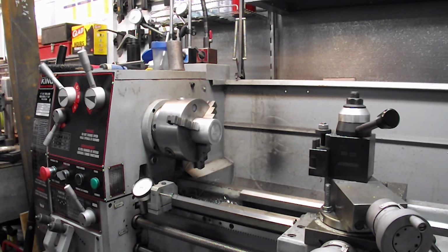I'm going to bore through. I need a .456 hole, and that's just about 3 thou over 29/64. So I'm just going to start and get a hole through it. I'm just going to drill it, and then I'm going to start cleaning up one side there, and I'll get it to the dimensions of my 1.930, and then I'll go to my 1.260 and get it to fit that wheel properly. Then I'm just going to flip it around and rinse and repeat the other side, and then I'll part it off to where I need it and bring her down to size as required.